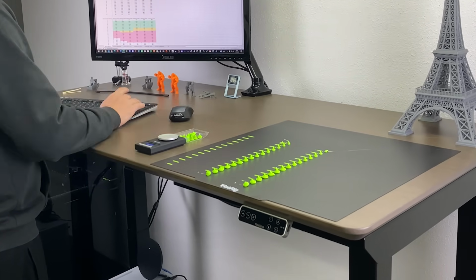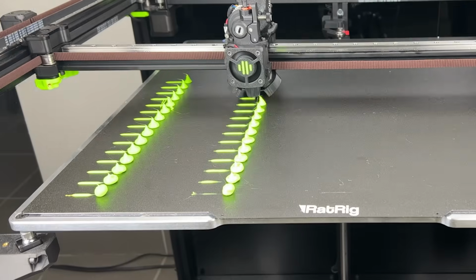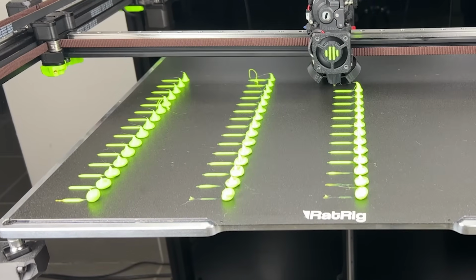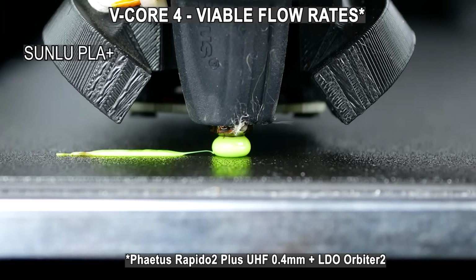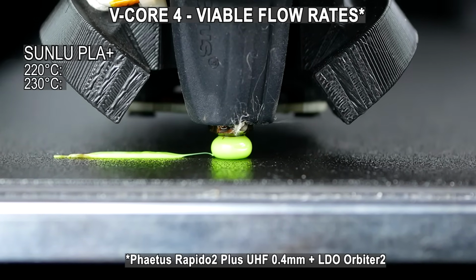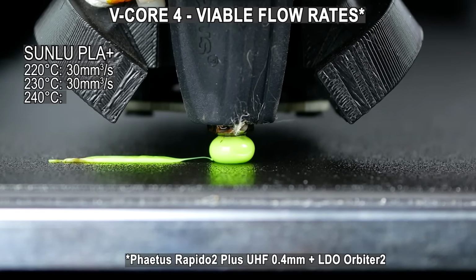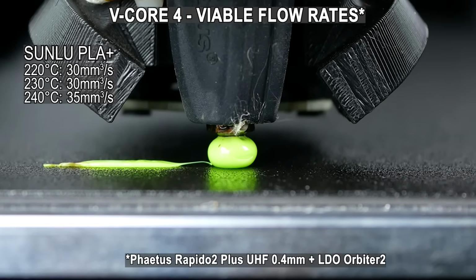With the spacious VCore 4 500 print bed, I tested each filament at 3 temperatures. Links to the tool and CNC Kitchen's explanatory video are in the description below. Sunlu PLA Plus at 220 degrees Celsius and 230 degrees Celsius performs well up to 30 cubic millimeters per second. At 240 degrees Celsius, it can reach close to 35 cubic millimeters per second.